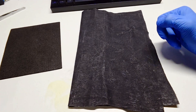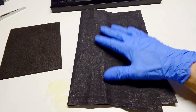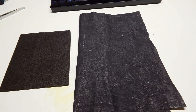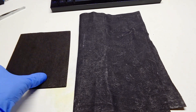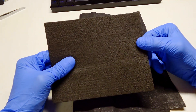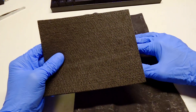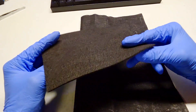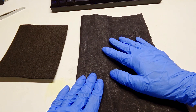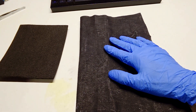Activated carbon material can absorb much more iodine than graphite materials. But because I already have a lot of experience testing zinc-iodine batteries, I had some interest to see how this graphite conductive cloth performs as a host material. For comparison, I also tested this PAN-based graphite carbon felt as a host material in a zinc-iodine battery. This PAN-based graphite carbon felt you can find easily on eBay or Amazon, and it has really nice conductivity and chemical resistance.